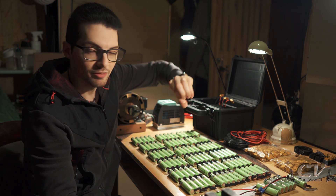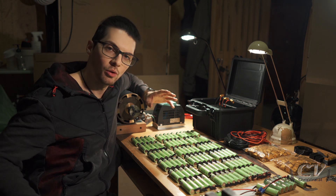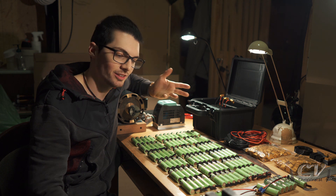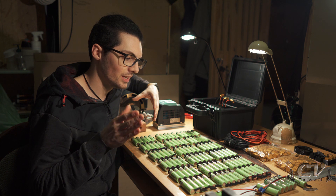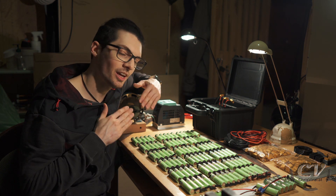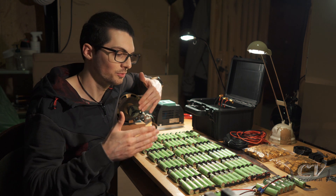The answer is 7S — absolutely 7S. But let's talk about 3S and 4S a bit more. My dad started his massive power wall project with a 4S configuration — 12 volts of course. And neither 3S nor 4S are really fitted for a 12 volt configuration. A 3S will be harder on the cells; they will get discharged more, discharged lower. When it gets to 4S, it's way softer on the batteries — they won't get discharged as low. What I've read is that 3S will give you maybe around ballpark 1000 cycles.